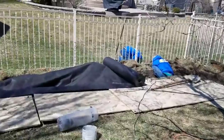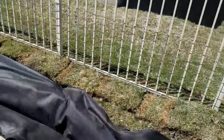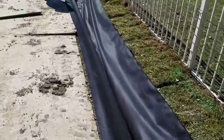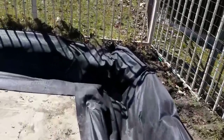Right now we're coring the storm drain catch basin. The guys will get through there with the core drill and put a piece of Schedule 40 in like I've shown in a lot of our videos, then put hydraulic concrete on both sides — that's the way they want it.